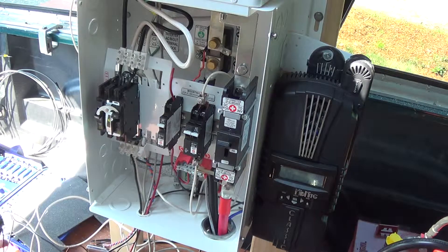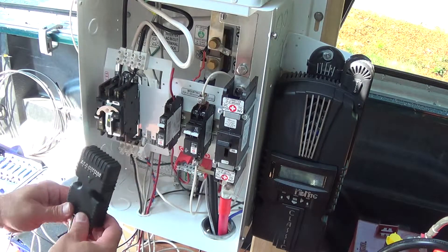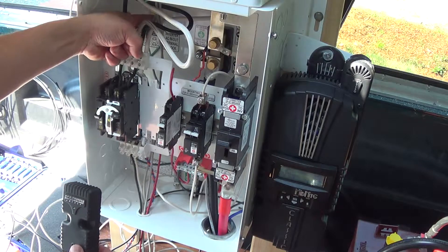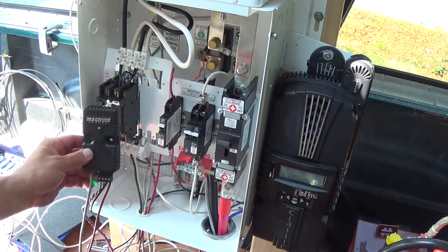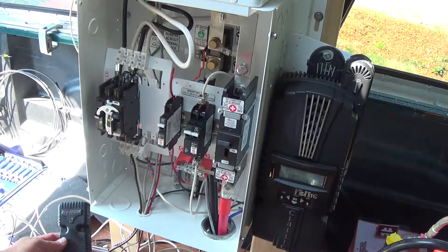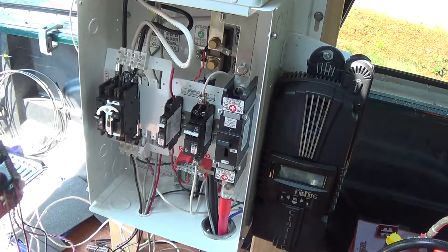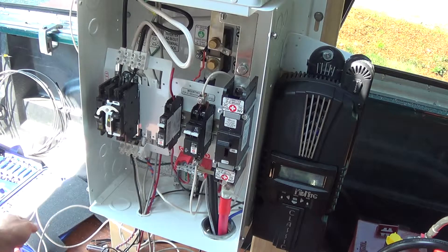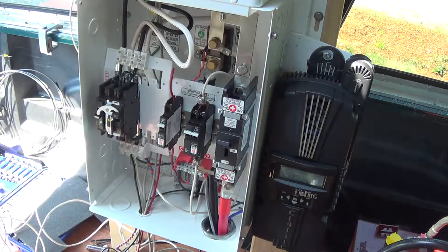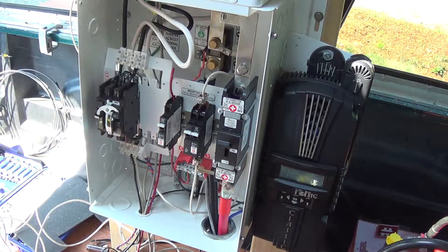This is the battery monitor. I had it mounted — there are two holes for it right in here. I watched some other guy's video and he didn't put it in there; he had it mounted outside. I was like, why did you mount that outside? And he goes, it gets pretty busy in there. And he's absolutely right — it's super difficult to mount this thing inside. Much easier to put it outside. Wrap the wires later and run them up where they need to go. Or if you're going to mount it inside, make sure the very first thing you do is mount that battery monitor, because it connects to this shunt right here, and once you put these six-gauge wires in, which are super stiff, it is super difficult to get behind there and do anything. I ended up taking it out and just running the wires up to it.